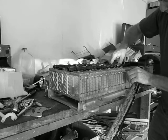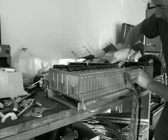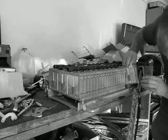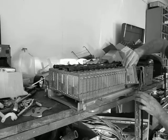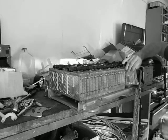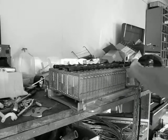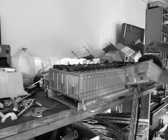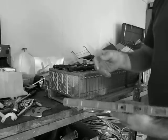Be careful of the green wires — those are temperature wires, you don't want to mess those up. You just want to pull the module. There's a set of wires underneath that I had not seen before, but I unclipped it. And so we have the one bad module pulled out.